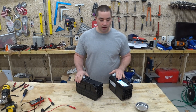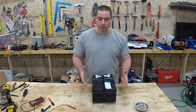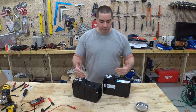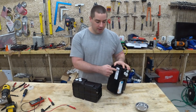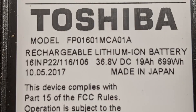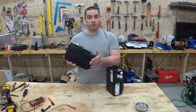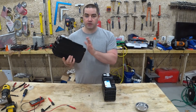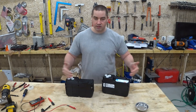Now, these are used batteries. They were used for about two years to start diesel generators — really big diesel generators. The two of them were put together as a pair to start the diesel generators, so they're slightly different between them. The sticker actually says the information for the pair, so it's not one module. The sticker says 36.8 volts for the pair, so we have 18.4 volts for just one module. One module is 11.1 pounds, or roughly five kilograms. So each one is going to be about 350 watt hours. These particular ones are 8S each, so we have 16 cells total.